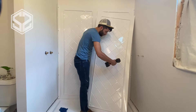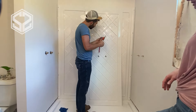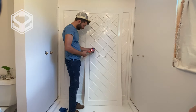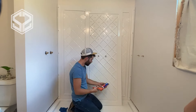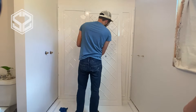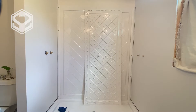We're having two shower heads — one on this side as a backup, and the main one on the other side. Once I have that measured out, I just used a drill bit and drove right through the plastic, really easy. Now I'm gluing up the back of this panel and putting a good bead of glue around both of those holes to help seal them in case any water gets in. The crisscross pattern and border glue work pretty well, but that extra dot in between each square works even better. It'll take about two tubes total with the dot pattern.